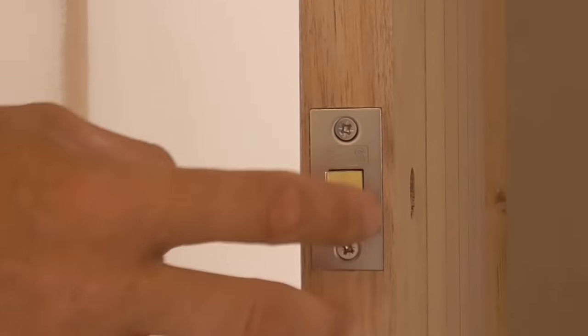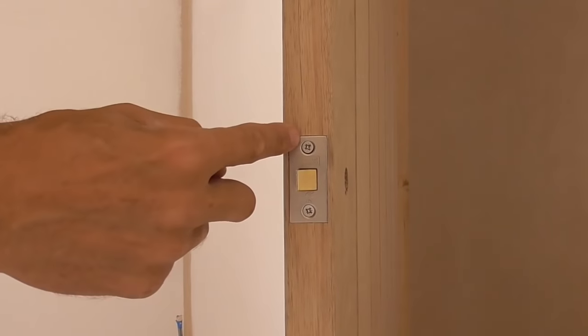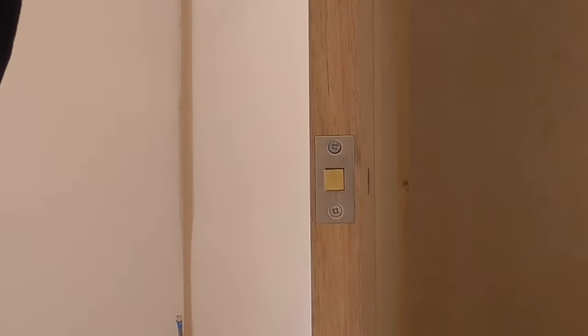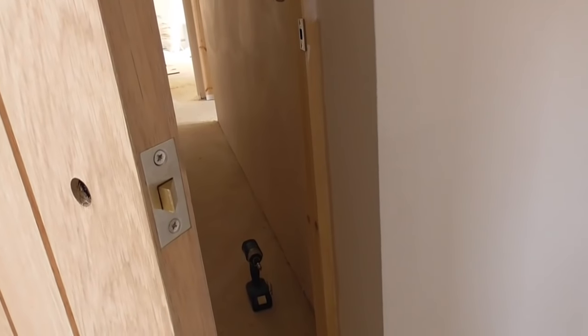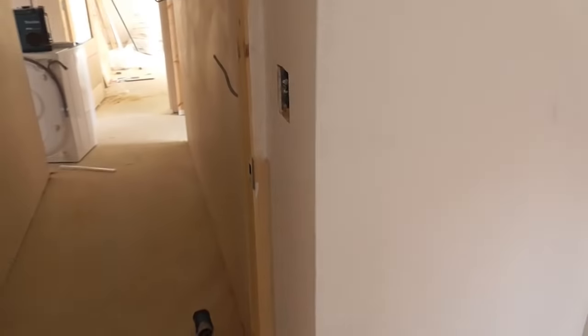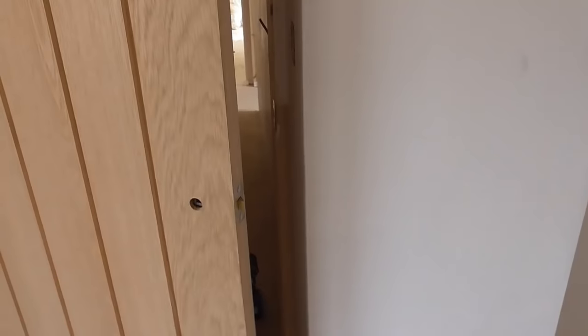There are lots of different ways of doing it. I should note that this latch has a loose faceplate — if you didn't have a loose faceplate, I would just push the latch in and still screw it up temporarily and draw around it. That's just the way I like to do it so you don't end up with pencil marks unnecessarily. I hope you've found this video useful for fitting a simple tubular mortise latch. It's fairly much bread and butter work of a carpenter, something taught quite early in our careers, and it's quite satisfying when you make a nice job of it. The other job is to fit the handles and I've done a video previously showing that. Thanks for watching.